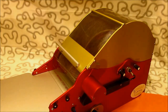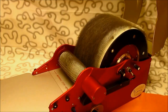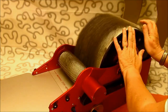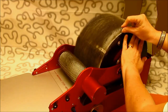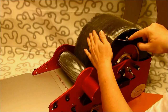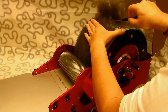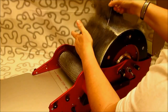I'm going to show you now how I get the batt off and how the fibers actually look coming from this mess out into a batt. When you stand on this side, you rotate the drum clockwise until you come to the point where you have the split between the two ends of the cloth. Here I just lift it up like so and separate it — you can see it's just separating very easily. The shorter the staple length, the easier it is to separate.